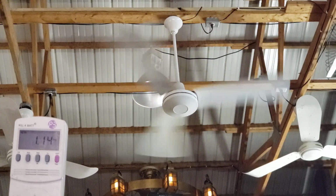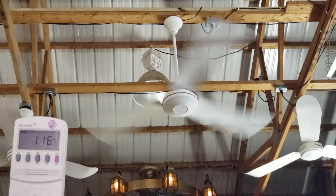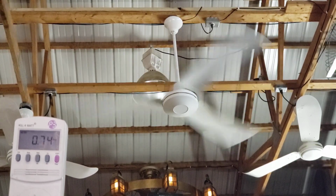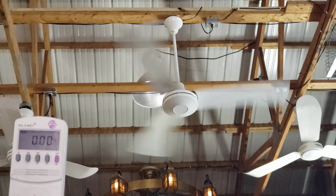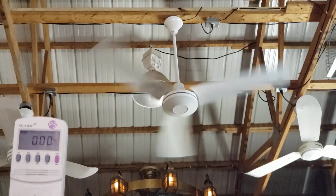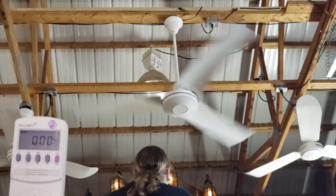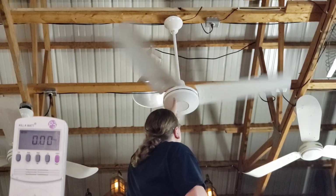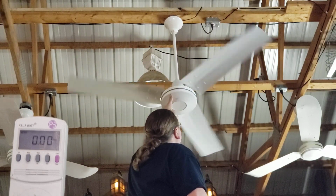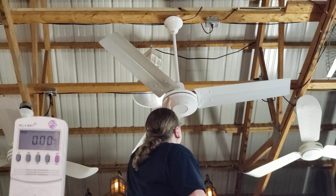These you'd want to use on a solid state control. I would say yes. Oh yeah. Because if not, that's why I asked you about using them at the other shop, like the Crompton. Well, the Crompton had a choke, but the Brown Dayton had... Back then, that one wasn't dead silent with the solid state, and back then every fan had to be dead silent for me, just like every fan had to have an aesthetic low. And I was also worried about stalling out, and with aesthetic lows, capacitors are more reliable than solid state. Okay, so the last one was right on the line between silent and bedroom quiet.